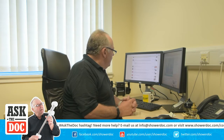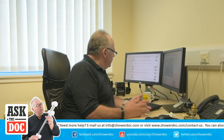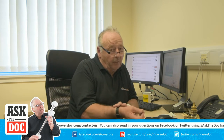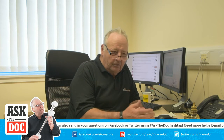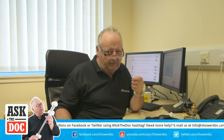Someone has a Triton T-80Z that's stopped working properly — not getting enough hot water on the normal setting, and the power is low. If he moves the knob to fully hot he gets really hot water but with very low pressure. I think an element has probably burnt out. Turning it up to maximum really just reduces the flow of water, so water travels through very slowly — low pressure and not very hot. That sounds like a faulty element, or possibly a faulty micro switch not letting power through. We have a video showing how to check and test the elements.